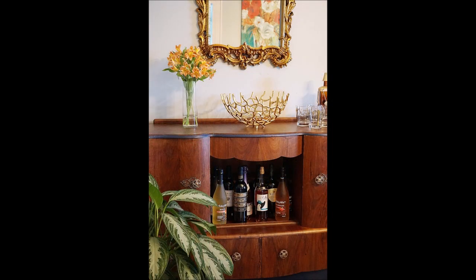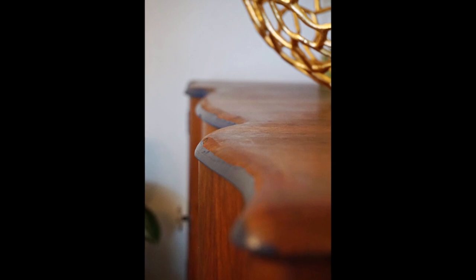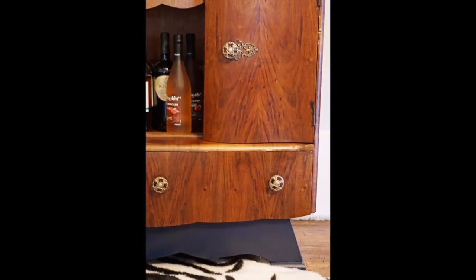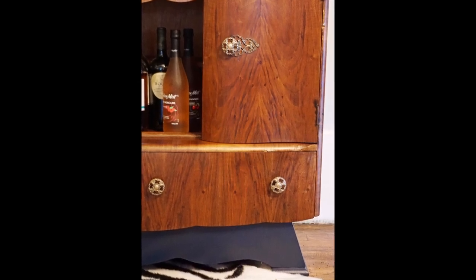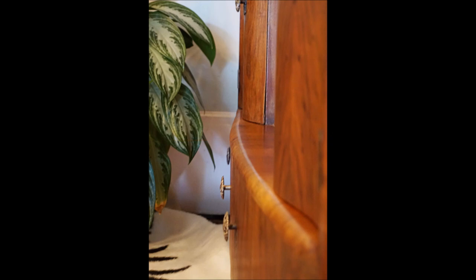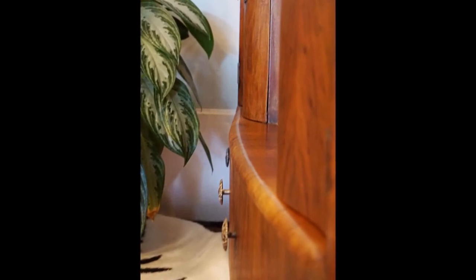This piece looked beautiful afterwards. I actually followed up with the Beeswax Oil and that was the finishing touch it needed. So I applied the Tung Oil about twice and the Restore-A-Finish twice, but in between each one I would let it sit for a day and dry and let it soak up the oil. In dealing with this wood furniture, you see that all it needed was just some oiling and constant oiling so it could actually penetrate the natural grains of the wood.